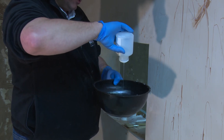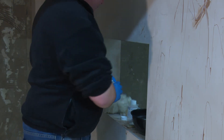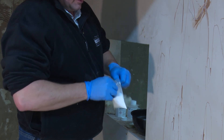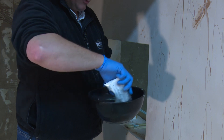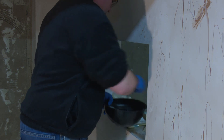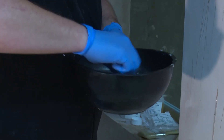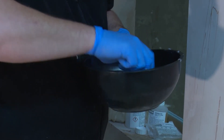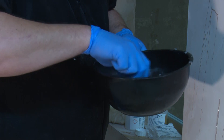Get as much as you can out of the bottle — there will be some wet out, but there is a reasonable error ratio on that product. The next part to add is the marble flour, which improves the viscosity, stops the resin from running out of the fibres, and helps to disperse any air. Stir this thoroughly until the powder is completely throughout all of the resin. If you do not do that, there is a danger that the two components of the resin may not combine properly, and you may get a failure to set, or sticky spots or soft spots in your supportive case.